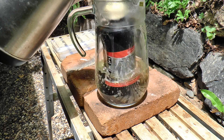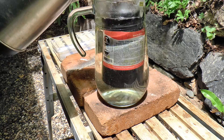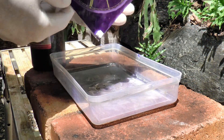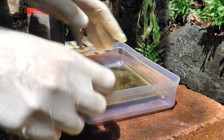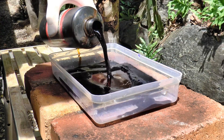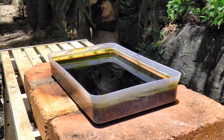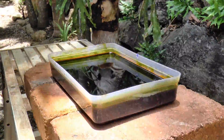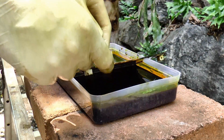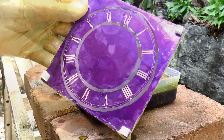The chemical reaction is certainly faster and more effective if the solution is heated. I pre-heat it by sitting it in hot water, and then ideally an aquarium heater would be used to keep it warm during the etch. But I've found that simply putting the solution in direct sunlight has a similar effect. After sitting in the etchant solution for about an hour and a half, the surface is nicely etched and it's ready for the next step.